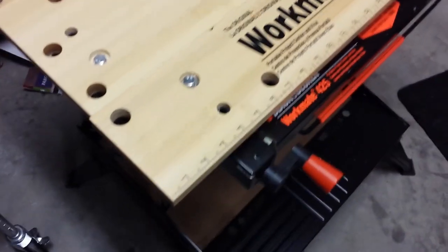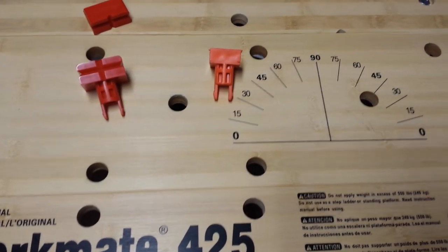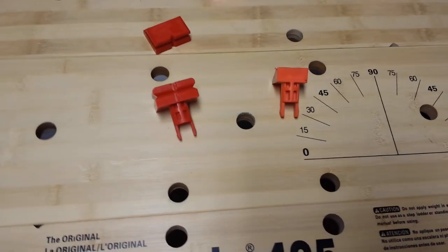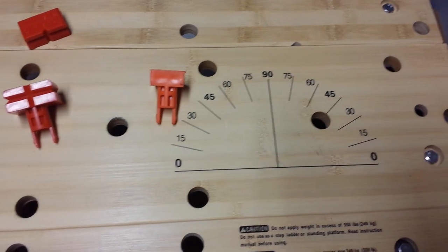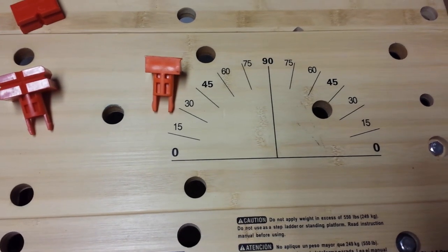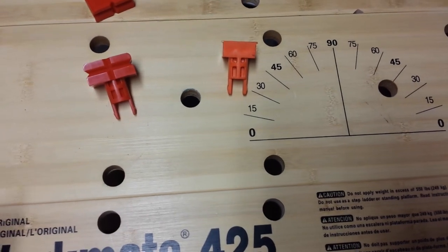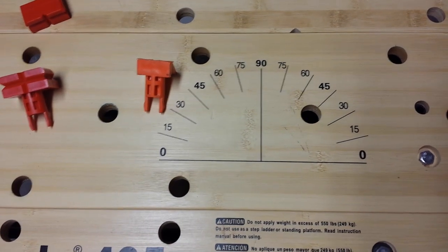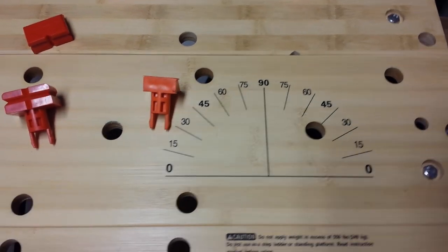The 425 benchtop is made of bamboo as opposed to particle board — I'm guessing it is laminated bamboo. I looked up bamboo on the web on the Janka (J-A-N-K-A) wood hardness chart, and native bamboo is harder than white oak, which makes it pretty hard. I did have to drill out these holes myself, and compared to drilling through a typical 2x4, this was far, far more difficult. I can't give a direct comparison to oak, but this was very hard to drill through.